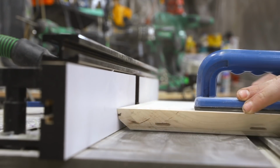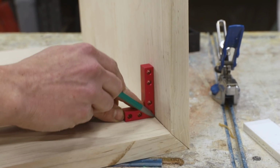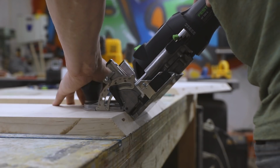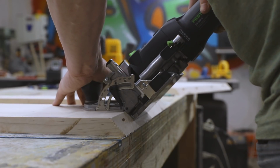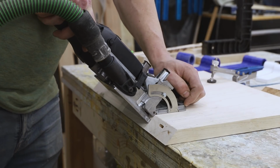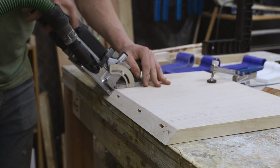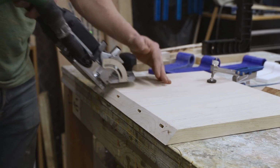Okay, enough design mumbo jumbo from me. Let's get on with glue up numero 2 for the mitered waterfall joint. It's pretty much the same drill as the last time. Dominoes for alignment, and then it was pretty straightforward from there. Of course, dowels or biscuits could also work. And in this design where the leg isn't load bearing, you could even go without reinforcement and just use glue and tape as a clamp.